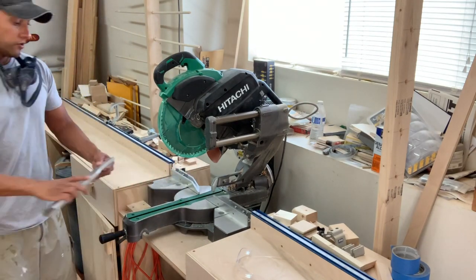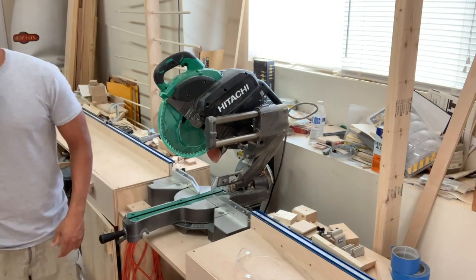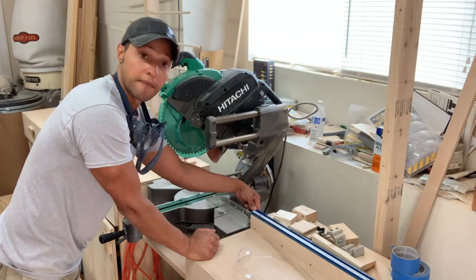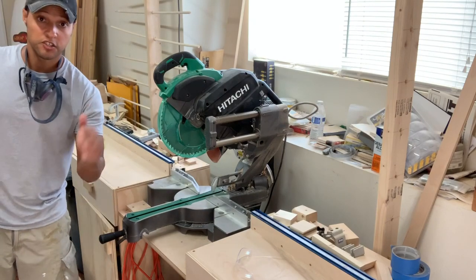What you need to do — you can see here I removed my miter saw upper fences and put those to the side. Most 99% of the miter saws out there just have a thumb wheel screw in the back. Loosen that thumb wheel screw and it slides right off.